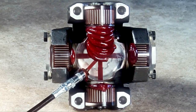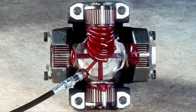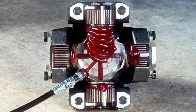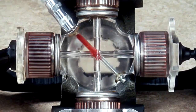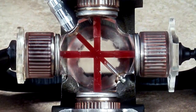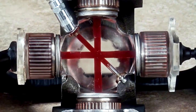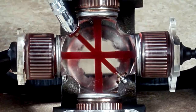After all four seals are purged, install new bolts and torque to specification. Remember, if you have to loosen any bolts or straps for any reason, you must replace with new hardware and torque to proper specifications. To ensure proper lubrication of a universal joint, be sure that the entire grease path from the grease fitting to the bearing seals is full. This can only be accomplished by purging all four bearing seals.